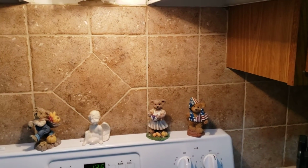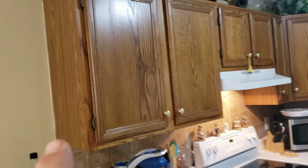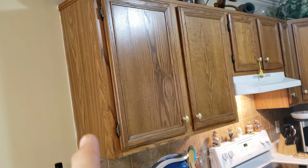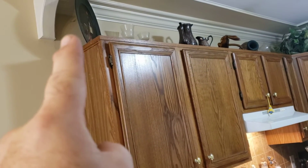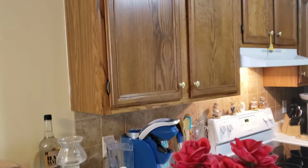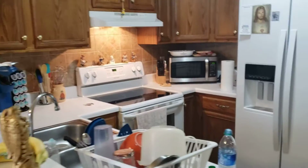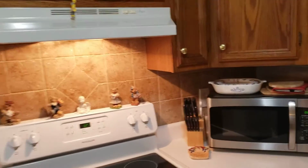It won't work there. So these two cabinets need to be left as standard, and we need to add a skin to the left-hand side of this cabinet, the 39/36. We need to add a skin to the left-hand side of it to flush it so that we actually have a finished end on this end. But again, that return for the crown and stuff up here will be just fine. That will maintain her tile. She wants to keep her tile backsplash as a cost savings. So no problem as long as we keep those cabinets standard, that needs to be left standard.